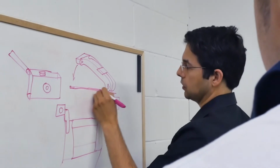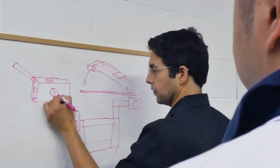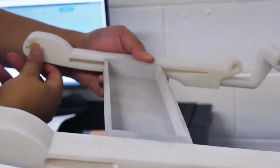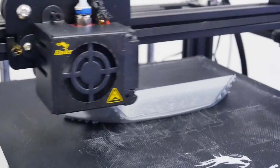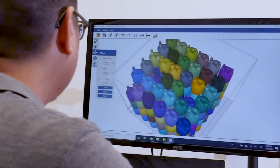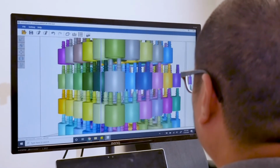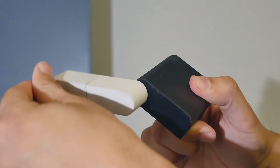The prototypes we manufacture during the design are manufactured using the same method as our production parts. So there's no setup cost when moving from prototypes to production. With FDM, we can only place parts two-dimensionally on the build platform. But with SLS, we can print parts throughout the build volume by stacking dozens of parts into a single print. This helped us increase throughput while reducing labor costs.